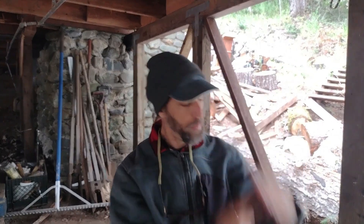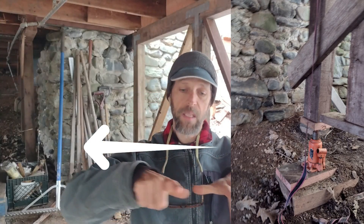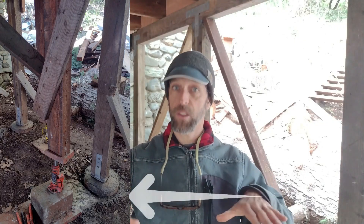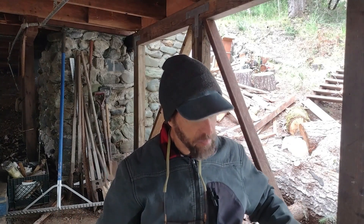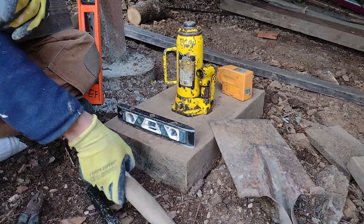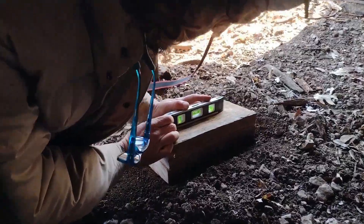We were on a slope, so we had to create flat spots about 12 by 12 or 14 by 12 inches underneath each spot. Use two-by-twelve material as the base of your jack. I like to take the back of a hammer and claw out the soil, making it soft and as level as I can. I use a small bullet level to check the soil side to side and back and forth until I've got it roughly as level as possible.